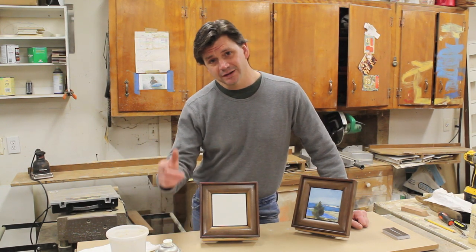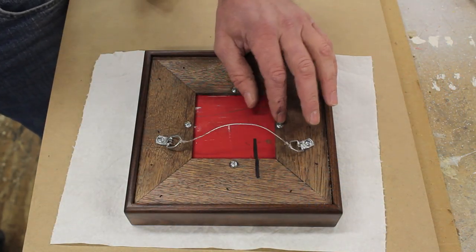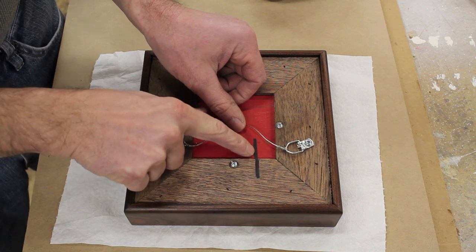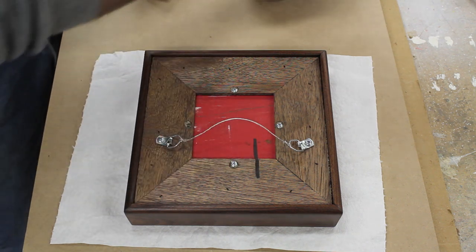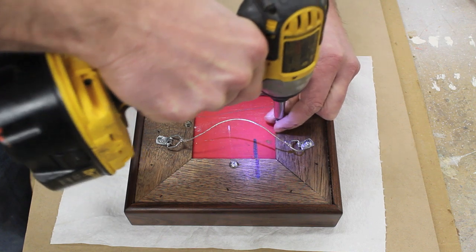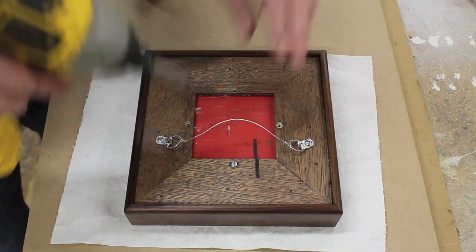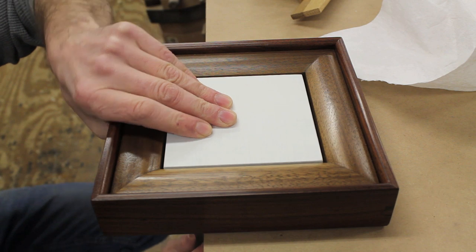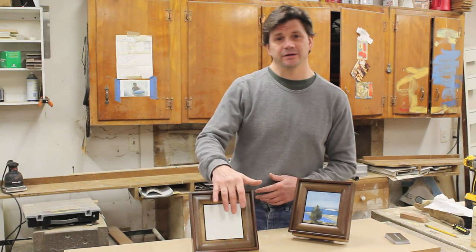What I'm going to do now is bring the camera closer and show you how to remove the panel and how to put it back in place. The panel is held in the frame with four Phillips head screws, so to remove it you simply remove the screws. I've put a black indication line on the panel so that when you put it back into the frame, lining up that mark will ensure the panel fits with a perfect reveal. The plywood is red only because it was a scrap piece hanging around the shop. To put the panel back, simply apply a little downward pressure and reattach it with the same screws — obviously making sure the painting is dry before you do that. It's pretty simple to take the panel in and out of the frame.